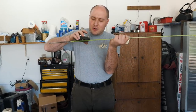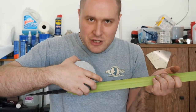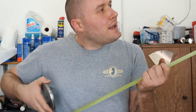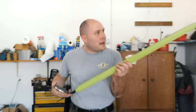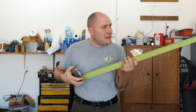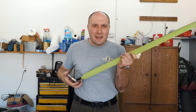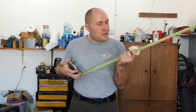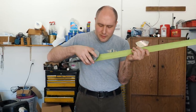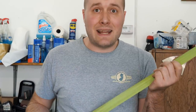A danger here is if I lay this down too flat, I'll put scratches that'll go up onto the blade a little ways. This thing will just scratch the daylight out of the sword, and I don't want to do that. Normally I sharpen at a 22 degree angle on a lot of my pieces, but since this is a big sword blade, made for less precision cutting and a more durable edge, I'm gonna go with more like a 30, 35 degree angle. But I'd still like to get it nice and sharp.